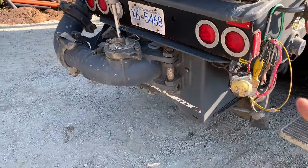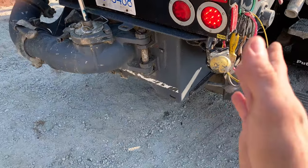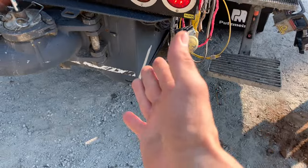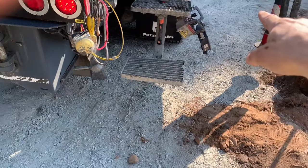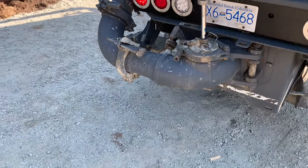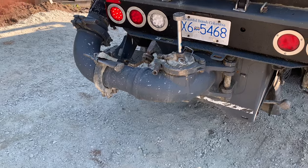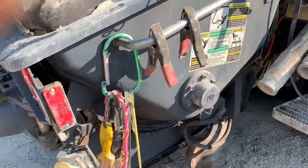The other thing I should mention about doing that, if you have traveled a long ways, when you put the pump in reverse, just in case the S-tube isn't gonna shift over, if it's segregated a little bit in the hopper, be ready to hit that interrupt, because if you leave it stroking and the S-tube doesn't shift, it can actually push the sponge the opposite way, which is obviously counterproductive to what we're trying to achieve. So anyhow, now we've done that.